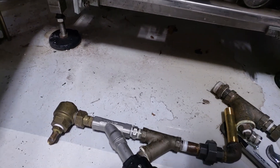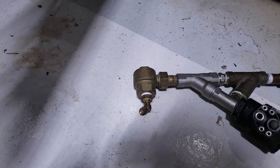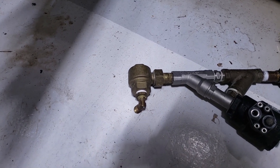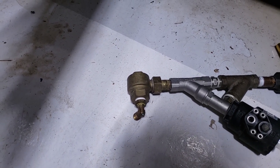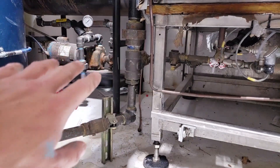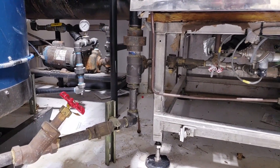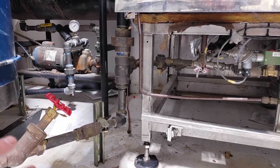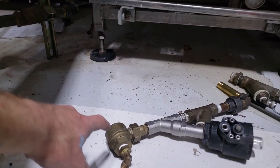For those who don't know what a trap is — it's basically like a thermostat switch. When the temperature is below your steam pressure equivalent (around 220°F), it stays open, letting all the air and cold water out. That condensate either goes back to the holding tank or, in my case for the chamber jacket, goes straight to exhaust. I don't want millet-tea water going back into the boiler — anyone who's run a pressure cooker knows the water at the end of a cook is a tea of whatever you're cooking.